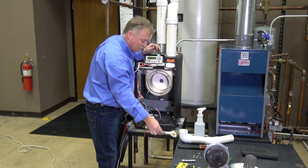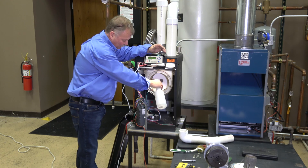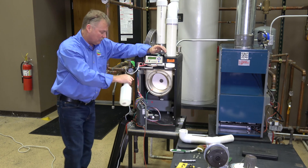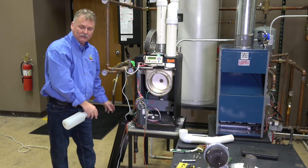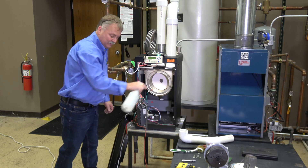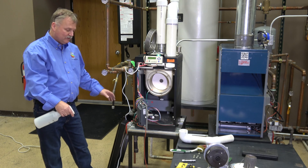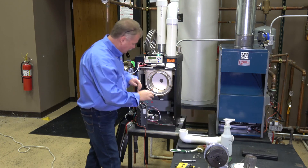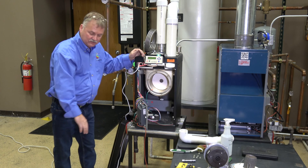It might take a couple times around, but push it around. They're not going to come out perfectly clean like brand new, but you want to get that junk out of there. Once we've got all that done, take your water bottle and spray everything down — all that stuff we loosened up, we want to wash it out of the heat exchanger coils. While we're doing that, we want to watch what's coming out the drain in our neutralizer. We want to make sure as much water as we're spraying in is coming out. If not, there's something blocking the drain — if I dump a whole bottle of water in and get a dribble out, that means something's clogged. On this boiler, there's a little plug on the bottom — you can open it up and flush it out.